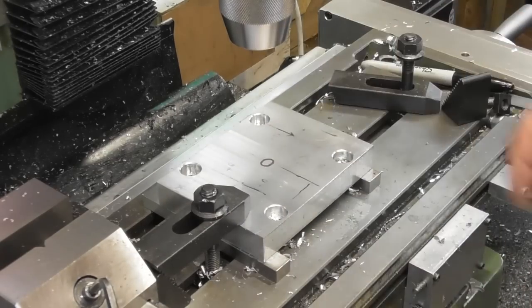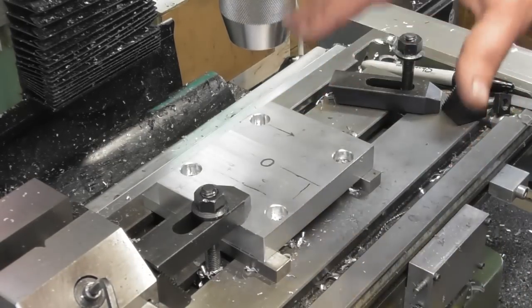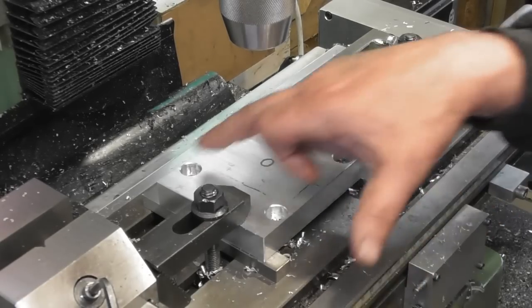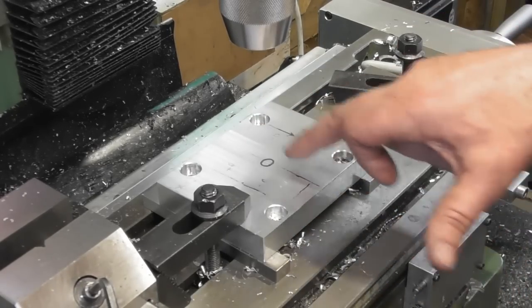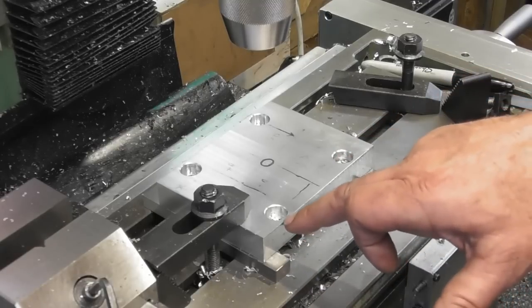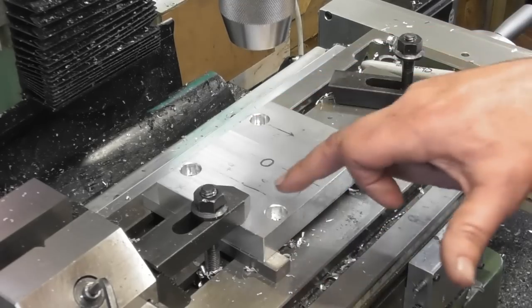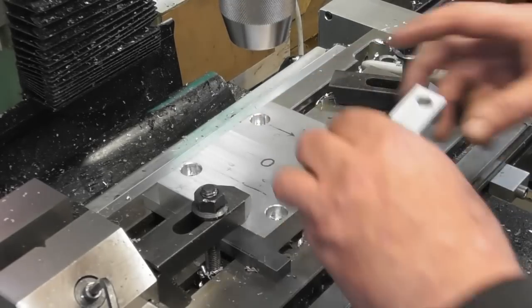Okay, so yeah, the four holes enabled me to clamp it down onto the rotary table. I did mark an X in the middle as a reference to get central about, and where I was 40mm out, because I didn't want these counterbores to break out of the surface, I just dropped the four squares back to 37/37s instead of 40.